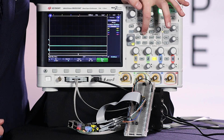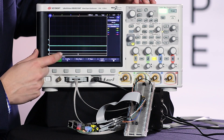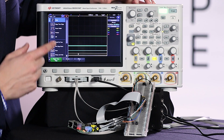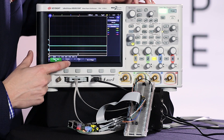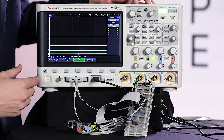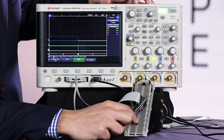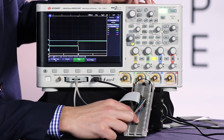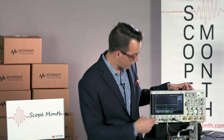So I'm going to go back into normal trigger mode — we talked about this yesterday so check out yesterday's live stream to see why we're doing that. I'm going to set my trigger to be an OR trigger and set all channels to either edge, which is going to catch any edges on any of my channels. Now when I press the button we should be able to see the transitions. You can see here it changes from three to four, four to five, five to six, and you can see that my debouncing was a little too quick and I skipped a number. I'd have to go back, check this period, time how long that transition takes, and set my debounce time for that period.